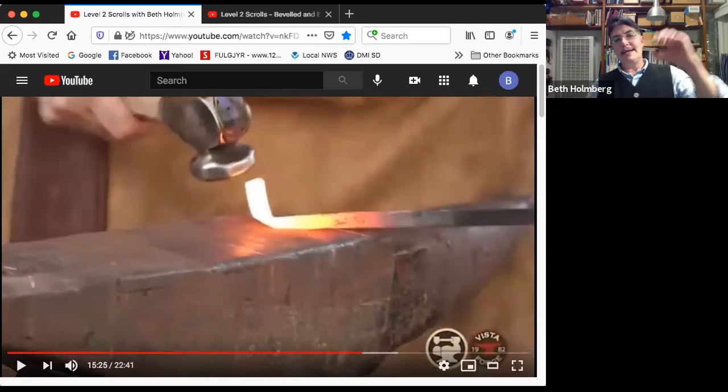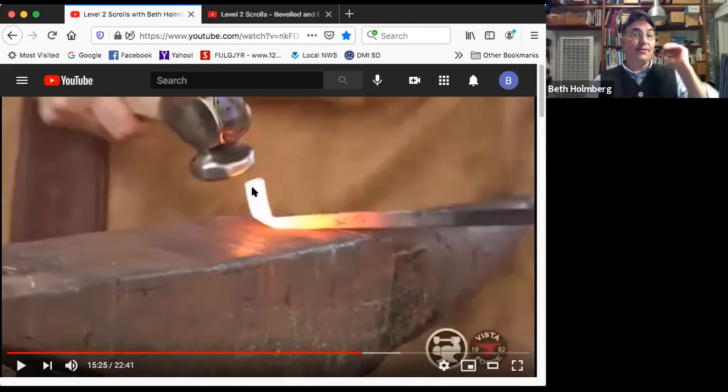All right. Now I'm going to take this shape and I'm going to upset it. There's a few tricks going on. I got to make that long thing into a square. First of all, if I don't hit it quite right, this will unfold and then it's pointless. Or it'll fold a little too tight and I'll get a cold shut in here.